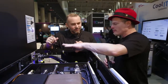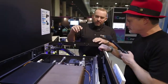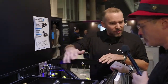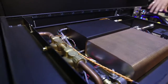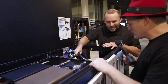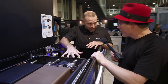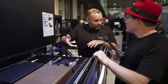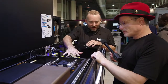Can you walk me through the PSI through here? It's not a very high pressure system because we have low flow resistance. The pumps drive circulation through these tubes and we're looking at well under 10 PSI for the entire circulation on the coolant side. On the facility side, that depends on the facility — it could be 40, 50, or 60 PSI. We want to make sure that's very well controlled and well regulated.